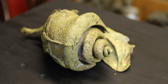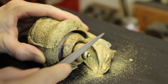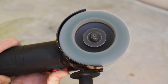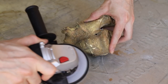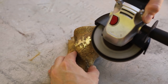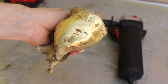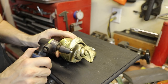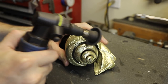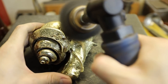Then I went to work filing and grinding off the excess metal that had leaked out of the vent hole and a few cracks. Using my die grinder, which is my favorite tool for cleaning up metal, I wire-brushed the casting and then polished it with a fine abrasive wheel. To shine up the metal, I used a super fine bristle wire brush, which really did a great job.